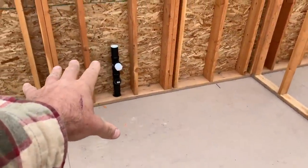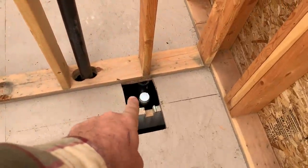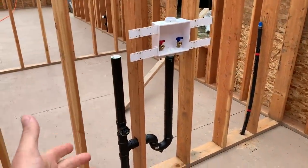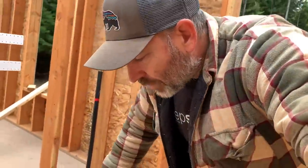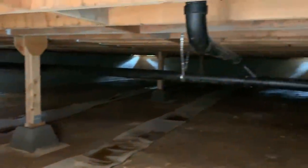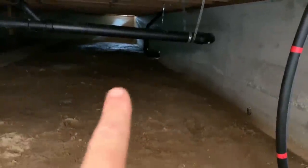Let's cruise up here and I'll show you what we've got going on. The inspector is coming today. We've got the kitchen sink right here, just capped off the vents. Then we've got the bathroom over here where we've got the shower/tub p-trap, vent for the toilet, toilet flange, and the vanity. We've got the washing machine box with p-trap, clean-out capped, and black poly coming up. Downstairs we've got three-inch ABS going up and out through the rim joist for the clean-out, then shower, toilet, vanity, and laundry. The poly pipe comes up into the wall, and over here we've got the kitchen sink with 90s going out through the wall.